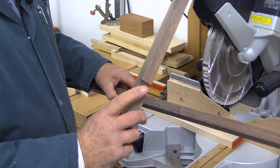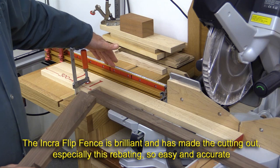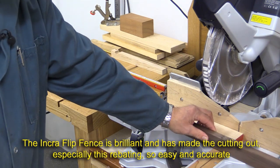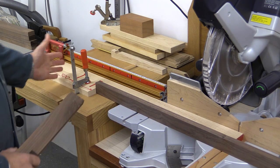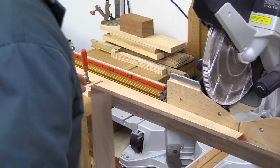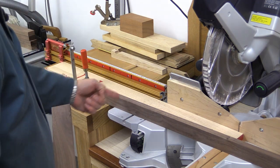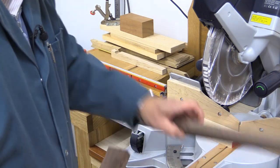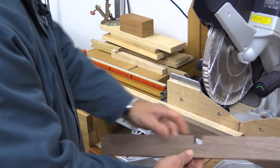I'm doing the joint between the central stile and the rail that goes between the two sets of drawers — they mesh together, so I've got to do some rebates here and here. You can see just how easy it is using the Incra flip fence. I've got a piece of wood here which brings the workpiece forward, as you need to do when making a trenching cut with a mitre saw. I've got an offset of 300mm so I can use the same jig close to the end of a piece of wood. I do the cut one side, rotate, then do the other side, ending up with a perfect matching joint.